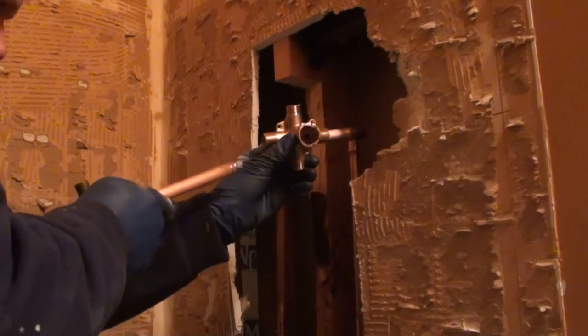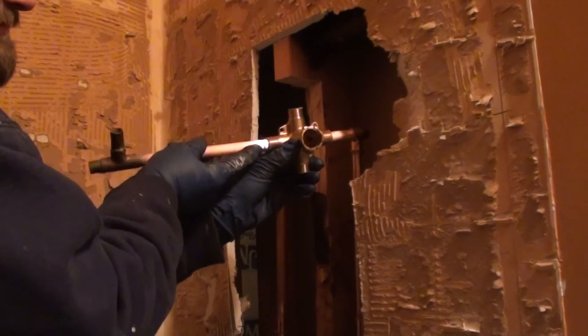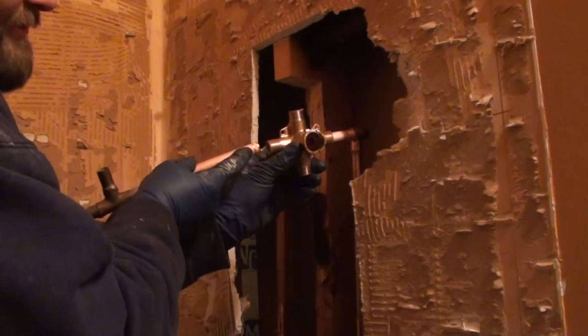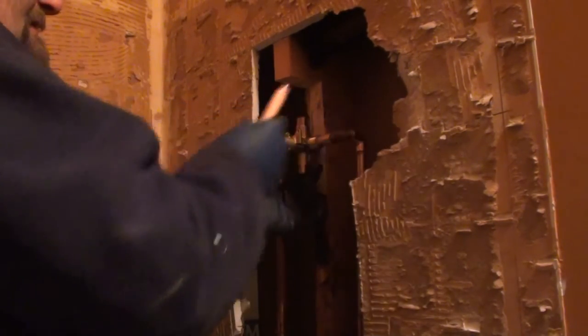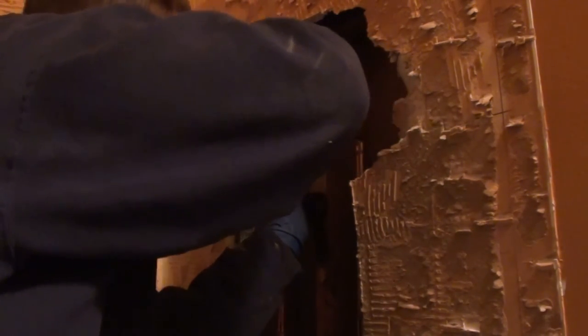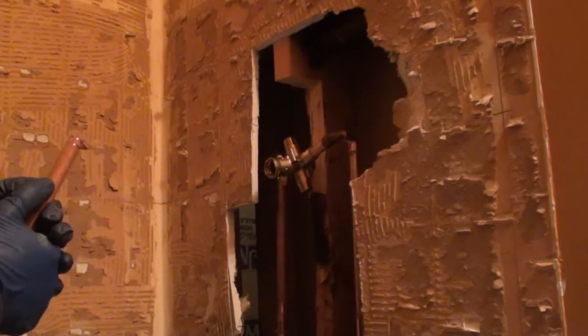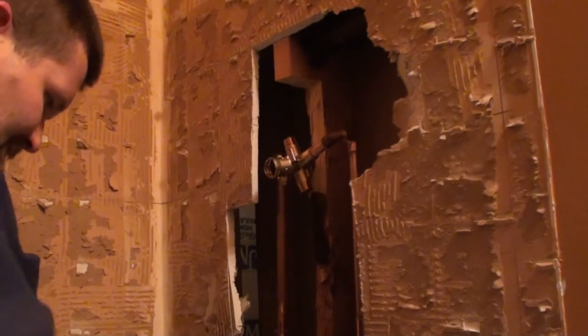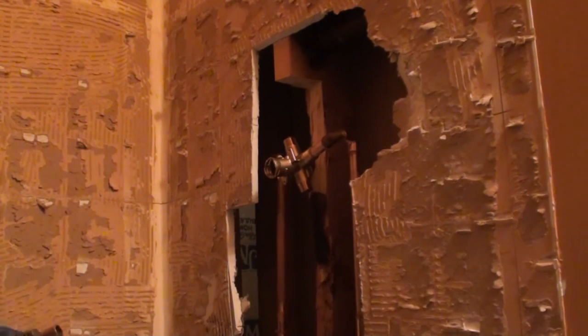Now on these valves, if you're questioning where your pipe goes to, do that. Take a mark, pull it out. Looks like it's probably almost a half inch. Make sure that this didn't slip out on that side. Kind of hold it up where you want it, and then get your measurement. If you're using rubber gloves, because of the tips being all bubbly, I've had that throw me off sometimes in the middle of doing a cut. So just be careful. You know the old corny saying, measure twice, cut once.